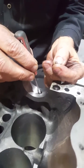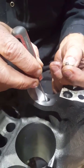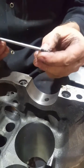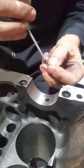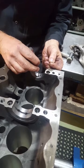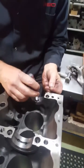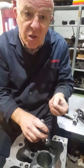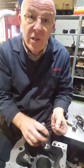You can't get these out with an air line because that hole — it's not blind but it goes around a right-angle corner and it's very, very difficult to get out. This is about the third or fourth time I've got particles out of this hole and there's still a load more in there which I'm going to struggle to get out. This is just a video to show you how much dirt is left in oil ways after line boring has taken place.